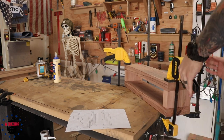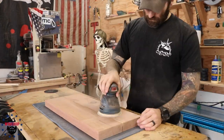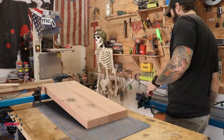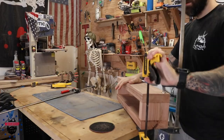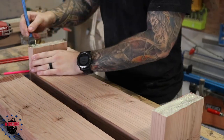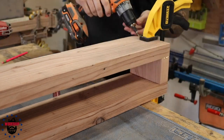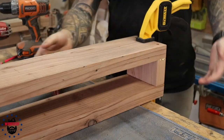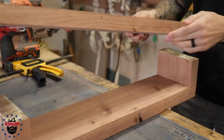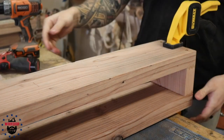The plan was to use glue only for all the assembly, but I was too impatient. I'd let it dry maybe 30 minutes and then start sanding or getting the next piece ready, and it wasn't fully cured. A couple of times I ended up popping off pieces, so I went back and reinforced everything with screws. That way you can just keep working without waiting for it to dry. I was originally trying to avoid hardware showing, but I don't think the screws look bad at all.